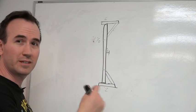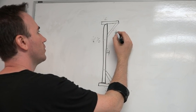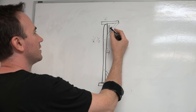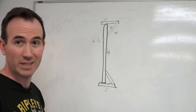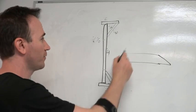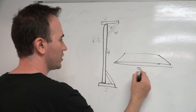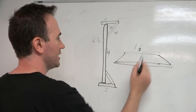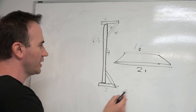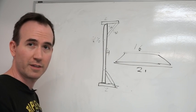These support structures are going to be 21 inches from farthest end to farthest end, and from the inside will be 16 inches end to end. When I miter it, I'm going to cut 45 degrees on either side — so the overall length will be 21 inches on the outside and 16 inches on the inside. I'm going with a two-foot piece and the 21-by-16 mitered edges. That 21-inch overall length is for my mitered edges.